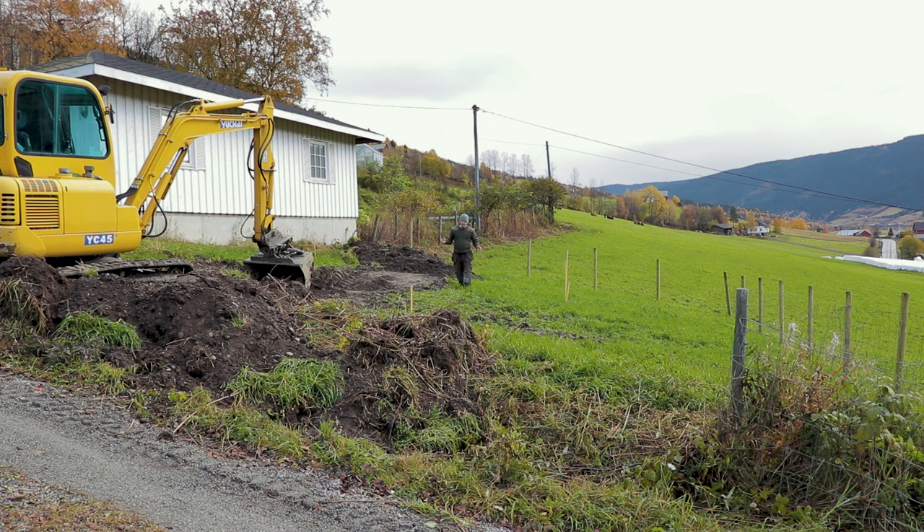What I'm going to be doing here is the house is going to stand almost directly on the soil. I'm going to use some concrete plates to align it and place it on. But at the bottom part, as you can see it's kind of steep here and I have to correct for that, so on the lower part of the property and a little bit up on the sides I'm going to place some huge rocks.